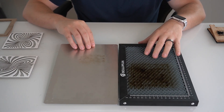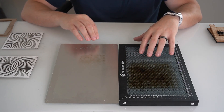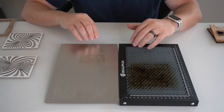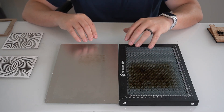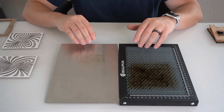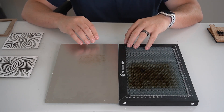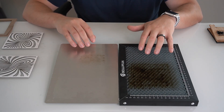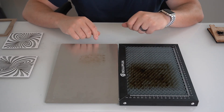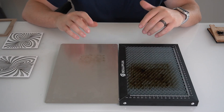A thin sheet of aluminum is good to have around when working with lasers. And then here you have the mesh system, which just sits on top of the sheet. You can use just the aluminum if you're just doing engraving, but if you're doing cutting you'd want the mesh as well. What it does is allow air to get in around all the parts when the laser is working so it's not burning the bottom as you cut through. There isn't one that fits the exact size of the Ender 3 bed — this one is 200 by 300, so it sticks out the front a little bit, but it still works.